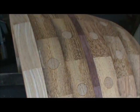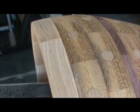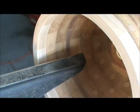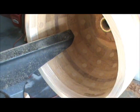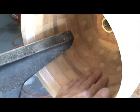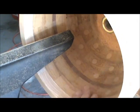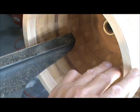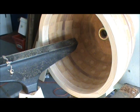I've got the final shape of the outside. What I do is just cut away everything that doesn't look like I want it to be there — everything that doesn't look like a bowl, I cut away, and that's how I get my shape. For the inside, you want to make sure there are no ridges — you can tell by feel. No high spots or low spots, pretty smooth in here. It's still going to take a lot of sanding. We're going to round over these edges, and then we'll start the sanding process in just a minute.